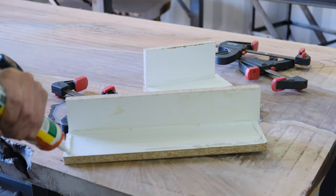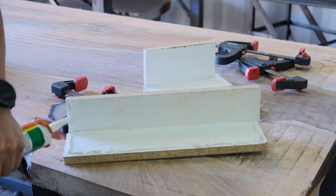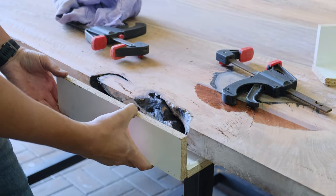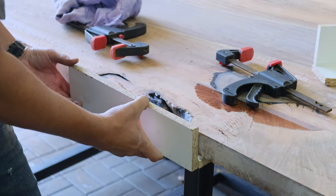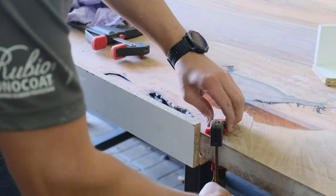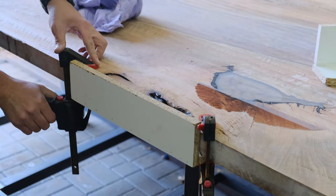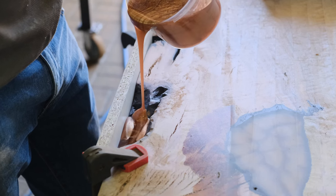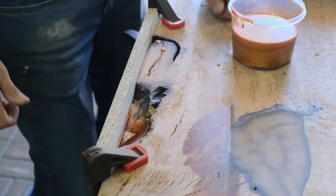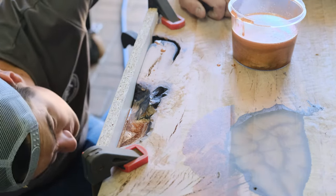On the side of our epoxy table we had very large broken-out cracks and holes we had to close. I'm using normal standard white melamine sheets with some silicone on the inside, pressing it right on top of our wood and clamping it down to make sure that when we pour the epoxy it's not going to leak out. I do want to apologize — for some reason I lost some footage on this project, and some of the coolest shots included the pouring, the preparation stages, and making the swirl marks in the solid color epoxy. Nevertheless, we have to continue with this project.